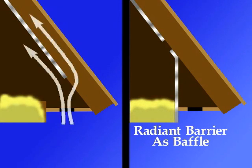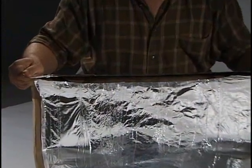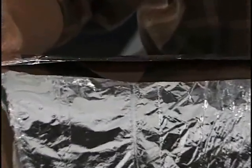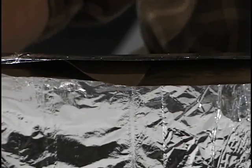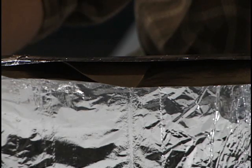At the soffit end, leave space for air to flow above the radiant barrier, and also leave some room between the bottom of the radiant barrier and the top of the mass insulation for air movement in the general attic space. Silver Shield radiant barrier is a multi-layer radiant barrier. There are internal expanders that separate the layers when installed, and only a slight pull is necessary to expand the layers.